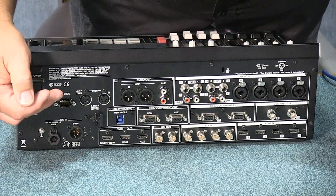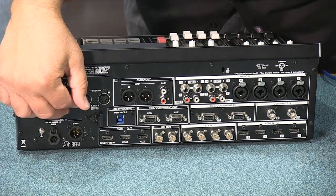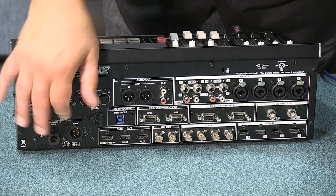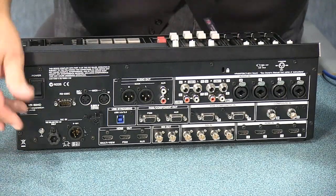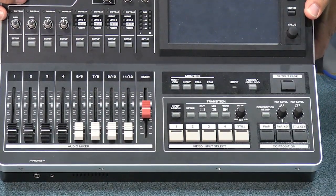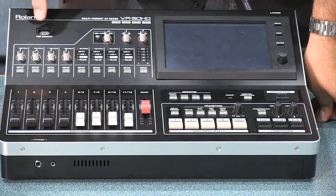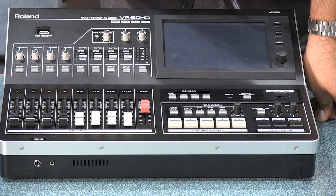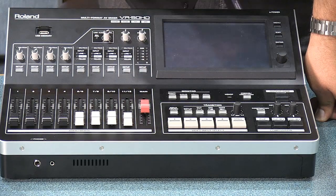The rest is power. You've got RS-232 if you want to control it with a touch panel system like Crestron or AMX. Say you have a weekday service, memorial service, or funeral — you can plug this into a control system and get video up and running without training somebody on the whole mixer. There's also a USB memory slot — it takes a memory stick, so all your settings can be recorded on it and downloaded later. If somebody else wants a different setup or you have a different show, both of you can use the same unit but have your own settings.